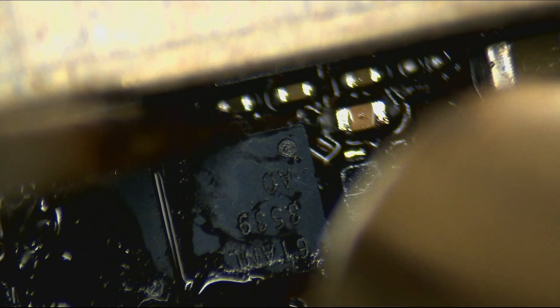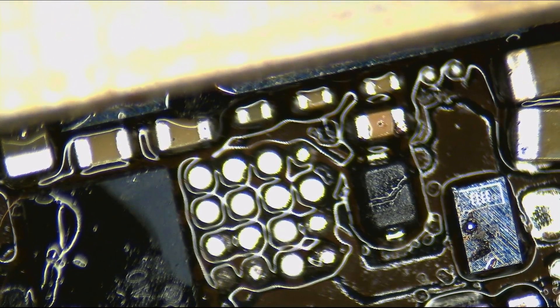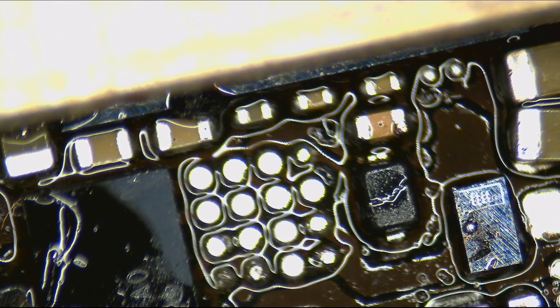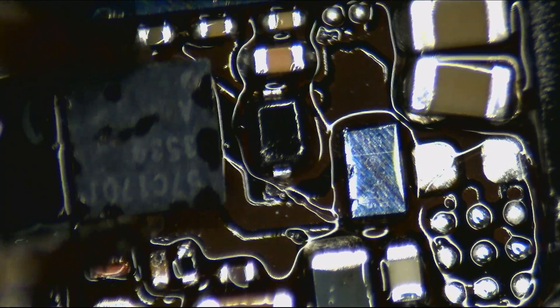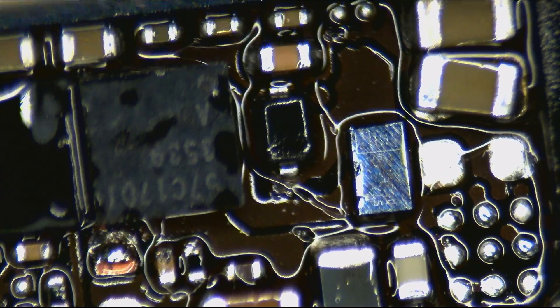Okay, so the chip is upside down in this position so I have the orientation. It was definitely the chip — look at those bottom-left balls. I bet the bottom-left balls on this would be for feedback or anything related to feedback or switching. I don't want to put a new chip on until those bottom-left pads are clean. Even though it looks like I'm scraping at the same intensity — I have a useless hand. It's really strange that I chose this profession.